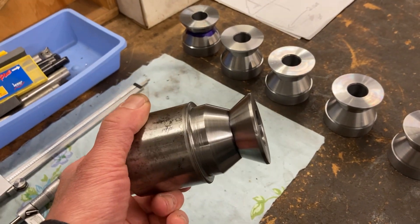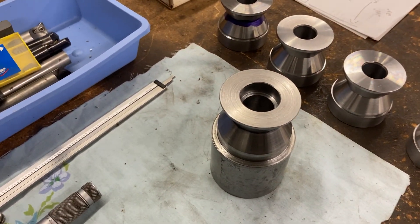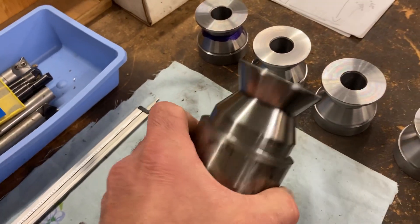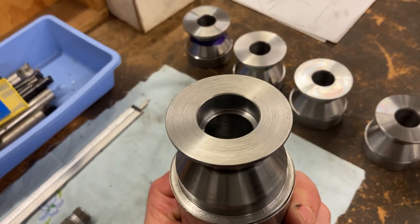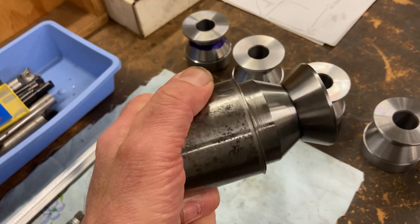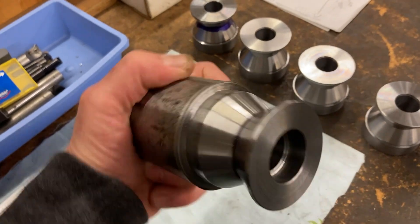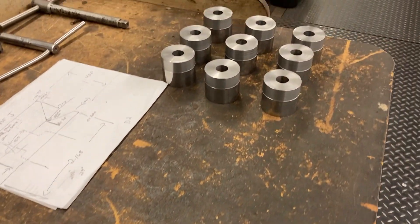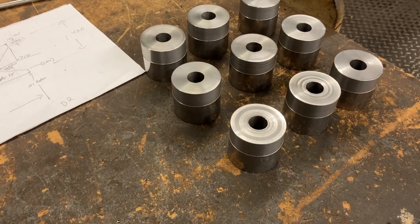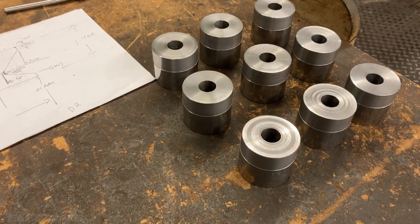So here's what we've got to do. We have a solid blank of material. We're going to cut the V, and there are bearings that press into this guide roller. That's going to be a half-thou press fit for a 28 millimeter bearing on each side. The customer brought me 15 pieces of material already cut, about three quarters of an inch longer than needed, so I've got material to hold on to.